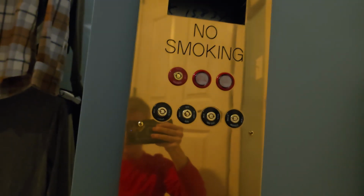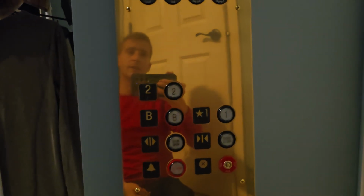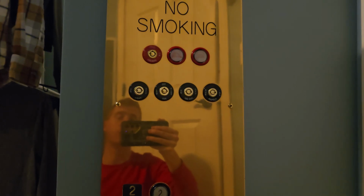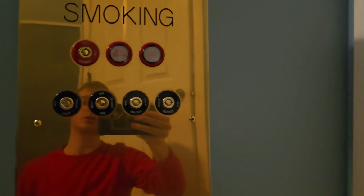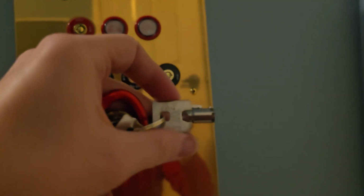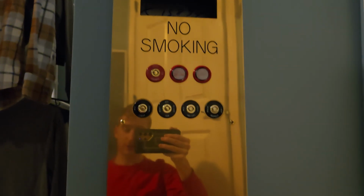I don't know too much about inspection service, but from what I've heard, as soon as you turn that on, you can't control the elevator from inside. You have to control it either outside or from the car top, and all the hoistway doors open up. So all of the doors on all the floors would open up, which is why inspection service is strictly for elevator technicians. So this takes the 514 key, by the way. So 514 key is only for elevator personnel, elevator technicians, and qualified inspectors.